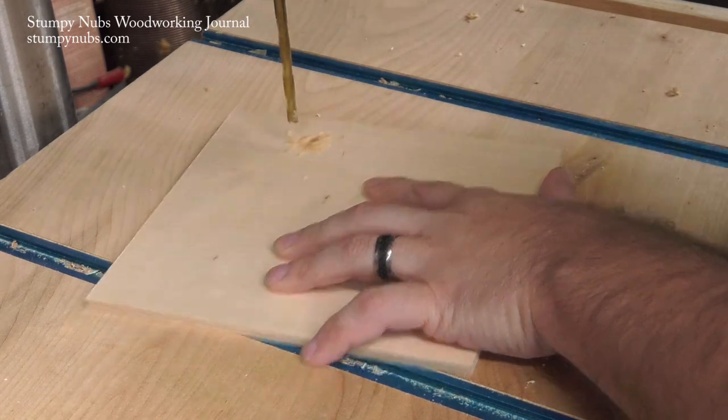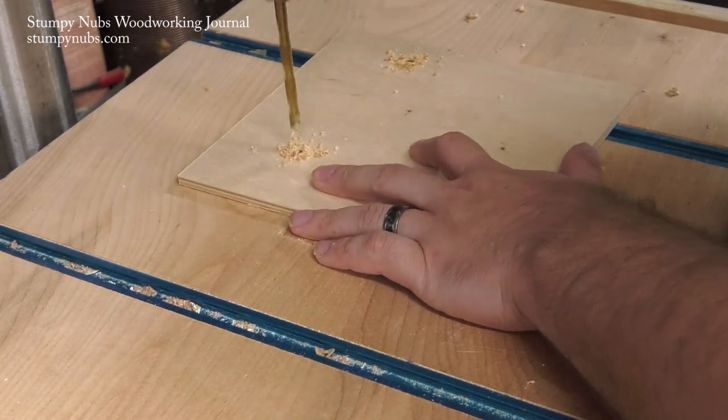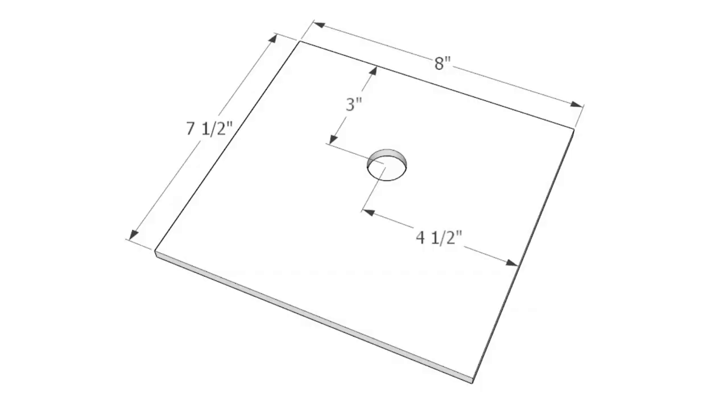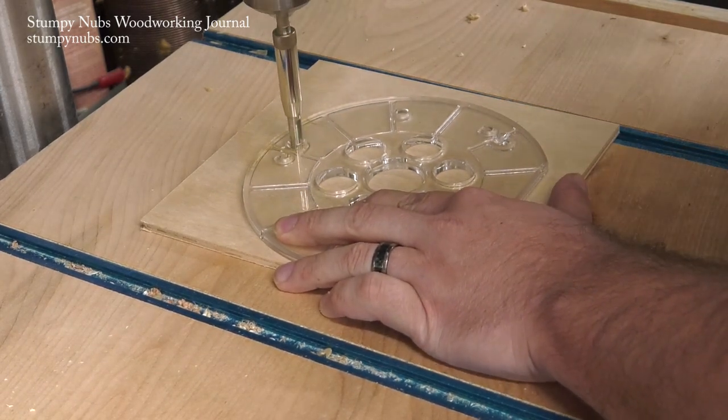This guide requires a custom router plate, which you can make from any stiff, quarter-inch thick material. I made mine from plywood — it's 8 inches by 7½ inches — and you don't center the router on this plate. Your bit must be offset. You can see the location of the bit hole in this drawing. Of course, you'll also have to add some more holes for screws to mount it to your router base.